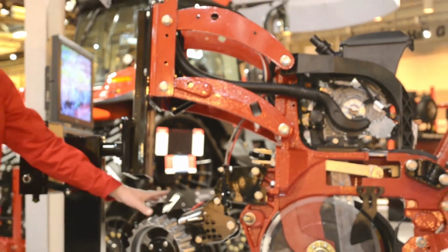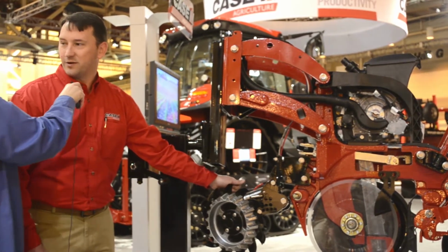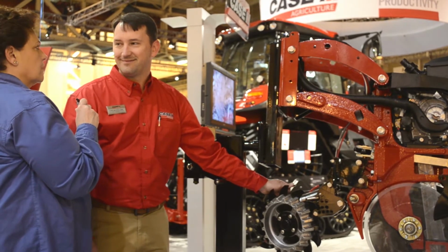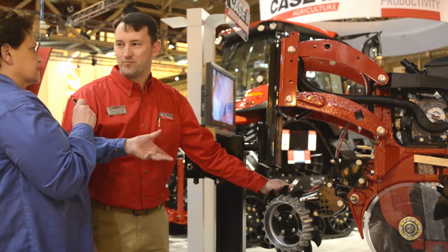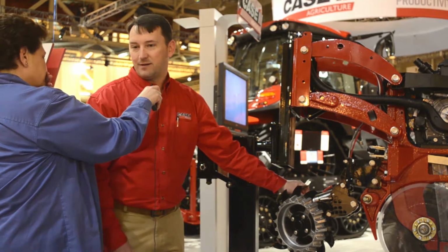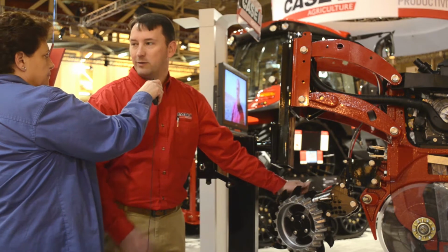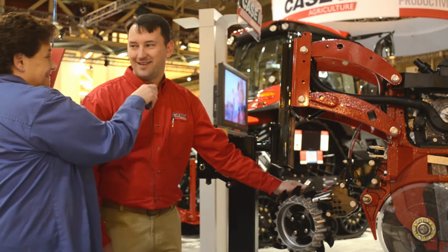If I kind of start at the front here, floating residue managers with an air cylinder, which allows for in-cab control based on the conditions that they're in. Whether no-tilling or conventional till, you don't need to get out and change it. You can just do it from the cab. That's another one. I know that we'll be talking about the Barracuda drill or disc a little bit later. That residue management, I've got to believe that inspired a lot of this hydraulics in that. Oh, absolutely. That's a key. Managing residue in front of the planter and optimizing your seed to soil contact and proper depth placement. If you can clear a good clean path for that row unit to work through, you're going to do a better job placing seed, which is going to give you a better stand. Right, and doing it from the cab, there's that ease of operation again. Yeah, you bet.